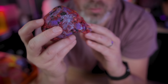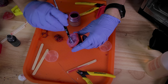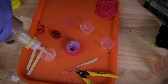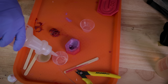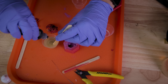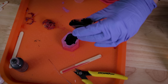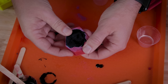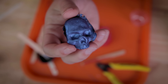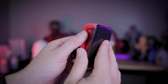Let's give this a go — oh my goodness, it's hot! There are definitely a lot of little pockets and divots from the filament not fully melting all the way. I think I just need to find a way to apply pressure while it's melting to really knock out some of those air bubbles. But overall it's a really cool way to use up extra filament, and this whole project is getting me more comfortable with creating silicone molds and casting — not just melting down 3D prints, but using molds to create duplicates, especially for someone who enjoys making and selling things online.